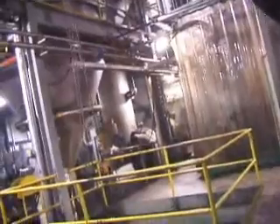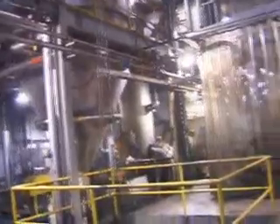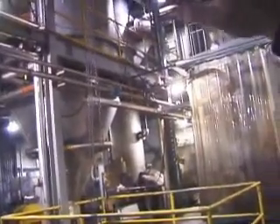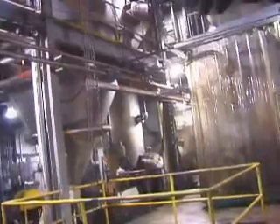This is an evaporator system that thickens the black liquor before we put it in the reformer to convert it over to energy. So that was a separate system that we designed for ourselves. This one has run for about two and a half years from HPD — that's a company in the States, a U.S. filter company. That system did work like a dream.